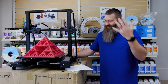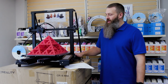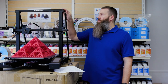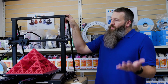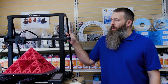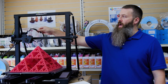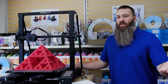So do I like it? Yeah, I sure as heck do. This thing has really impressed me while I've been printing with it. We've printed lots of different things and tested out lots of different issues I thought maybe could exist. I thought maybe the photoelectric filament detection sensor would have a problem with clear filament — it doesn't. Maybe I would swap out the hot end to one of the Micro Swiss hot ends that they just came out with recently, which gives you an all metal hot end and eliminates some of those nozzle clog issues. Maybe put a Bondtech BMG extruder on here, maybe some Capricorn tubing, maybe use the community firmware — but as a stock machine it's still an excellent performer. Those things would just make it even better.